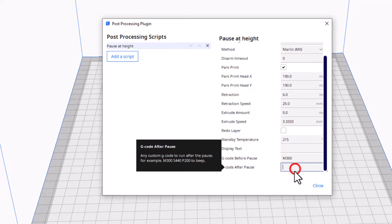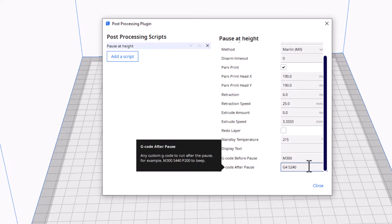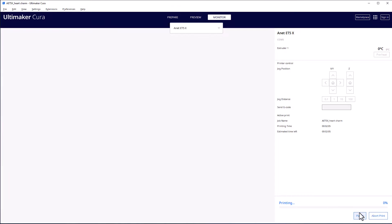After the pause we're going to give it a timeout, so we are going to manually change the filament. The code for the after-pause is G4, space, S, and I'm going to put 240. That gives me quite a bit of time, but when you're doing a manual filament change that's pretty handy. The computer detected the printer so now we're going to switch to print via USB. With our code in place, let's hit Print via USB.